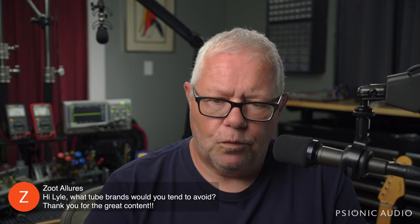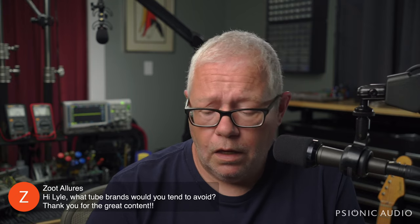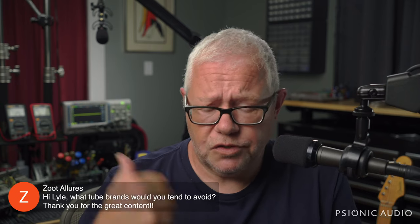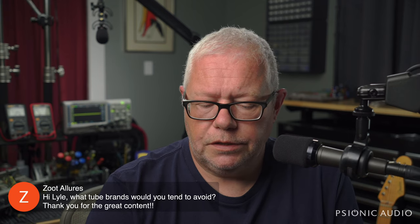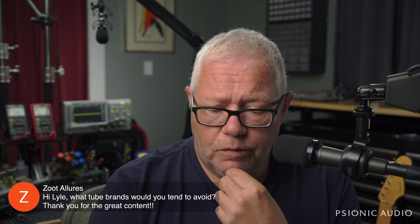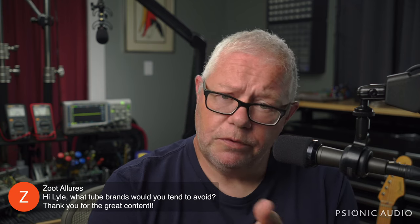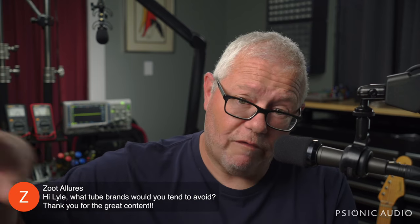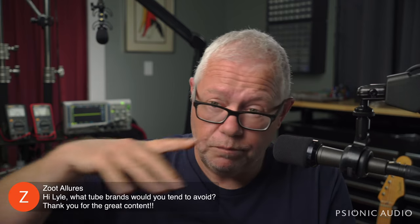Electro-Harmonix preamp tubes: the ones which are silver print and say 7025, they're fine. They're good. Electro-Harmonix 12AX7s with the yellow print, absolute garbage. Toss them. Tung-Sol 12AX7s used to be great, and then before the tube shortage started, I was encountering a whole bunch of them which had hum issues in Fenders and a lot of bleed between channels. And I've not tried them since because they were off the market for so long. I hope when they do come back that that issue will be corrected.